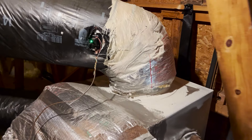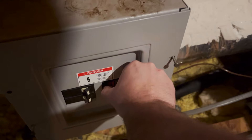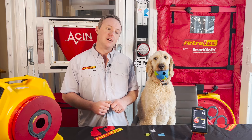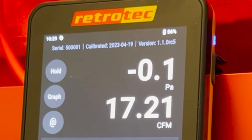Once we have that pressure, we turn the HVAC system off along with anything else that will manipulate pressure across the building — such as exhaust fans, dryers, combustion appliances. My system has a whole house ventilation that runs automatically via a Haven indoor air quality monitor, so I'm flipping the breaker off at the air handler to make sure nothing kicks on during the test. We're dealing with lower pressures than typical blower door tests — here we can see about a six pascal pressure difference between the bedroom and the main body of the house. So we're going to bring the whole house up to that pressure. With the second blower door installed in the interior doorway, we bring that one to zero to neutralize it, so the only leakage reading on the room blower door is leakage to the outside.